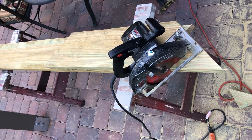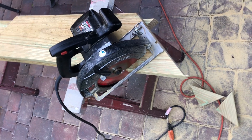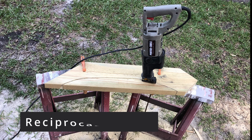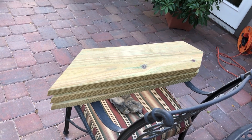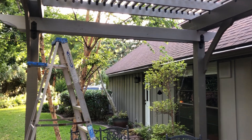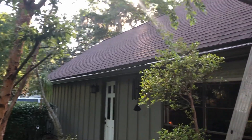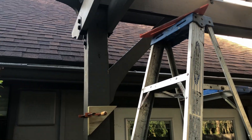These are two-by-eights, 16 feet long — I'm cutting four pieces for the other corners using this saw. These are the last cuts I have to do, and the rest are right here, all cut. Then I use the other saw to cut the curves before installing them. There are three cuts here — they're all 45 degrees. These shorter ones go right in those corners. I installed one of them and it definitely looks awesome. I'm now installing the second one — that's how I level it, screw it into the wood.